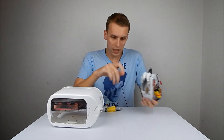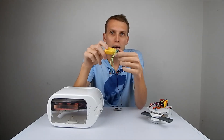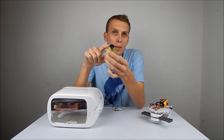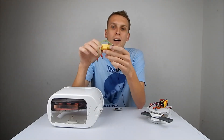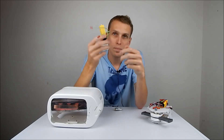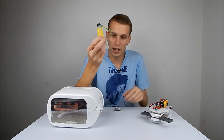The other issue was we were using these plastic geared motors for drive last time, and that was a bad idea. They're normally held in with a little plastic clip, but that interfered with the fit so I had to remove it and use hot glue instead — and that didn't work so well. One motor survived, but the other one got ripped out at some point, which meant I lost drive. These things are terrible. I probably shouldn't have gone with them, but they were there and it was a quick and easy solution.